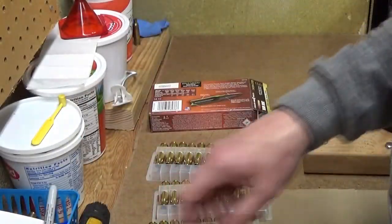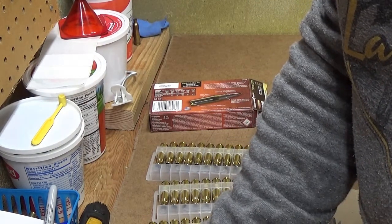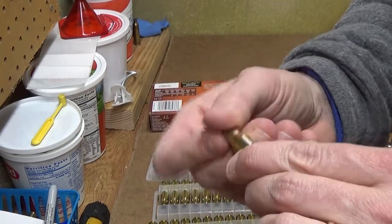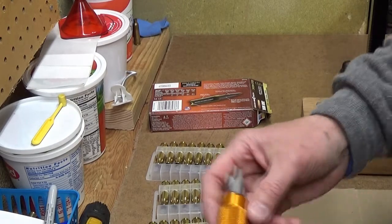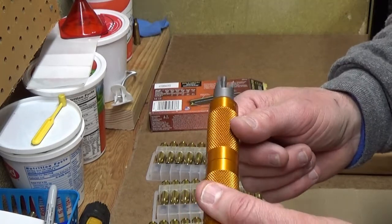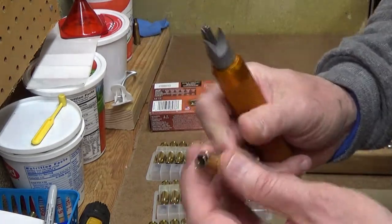Assuming they have the same brass, same primers, same everything. After I shot both batches twice and reloaded them twice, I trimmed the brass and neck sized them. Now I'm going to reload them and I realized that if I put my finger on them I can still feel a little roughness — it's not smooth. So I got this Lyman chamfer and deburring tool for Christmas, which I didn't use to have. I had been using a Lee cutter with a built-in chamfer and deburring tool, which does a good job, but on these particular cases I can tell they're still a little rough.